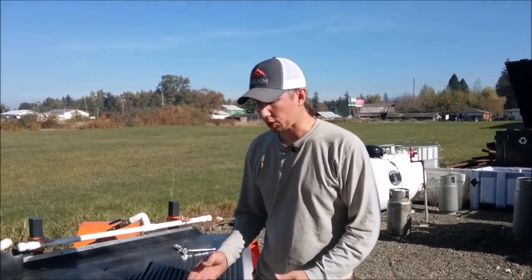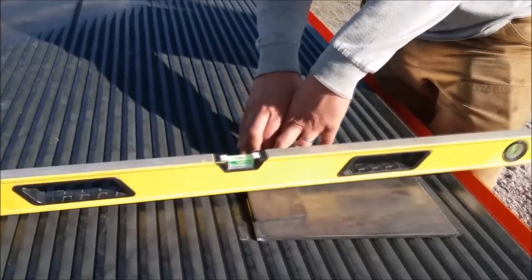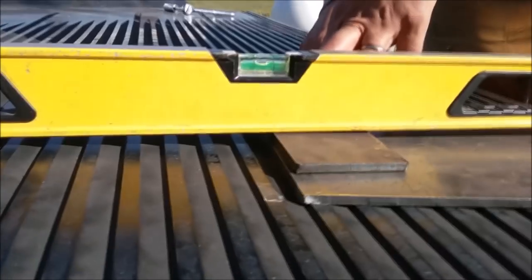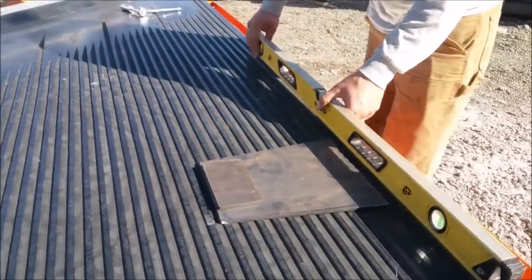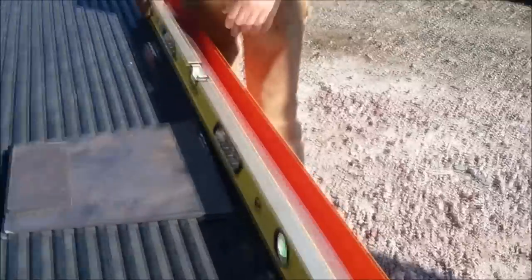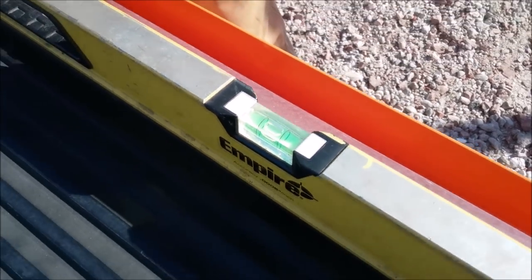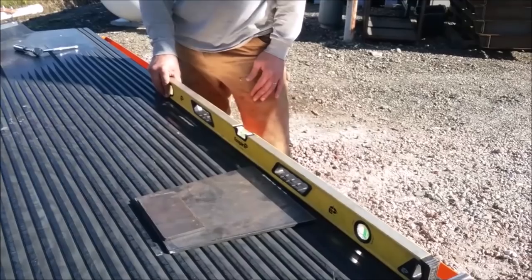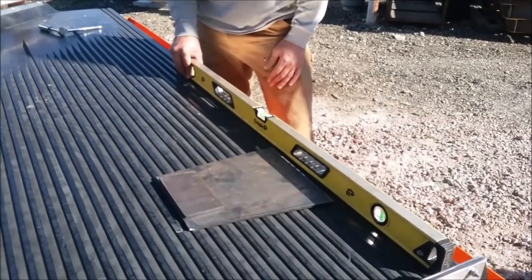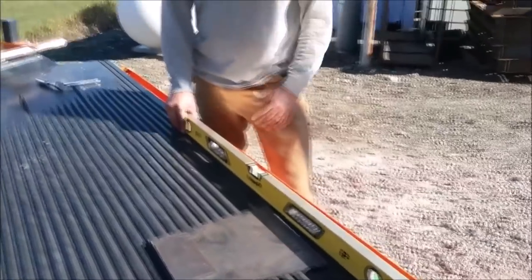The easiest way we've found to level the shaker table is by spacing off about half an inch in two feet, then getting your level resting at two feet on that shim so we are level in this plane. Then check to make sure we're still parallel in line with the grooves. When using a long level, stay away from the ramp because that will throw off the reading. We're level in line with the grooves, sloping down towards the tailings trough at a quarter inch per foot, or half an inch in two feet. At these specifications the shaker table works great for all different sorts of material, such as gold ore, PCB material, copper chops — it's a really optimal setting for pretty much any density separation.